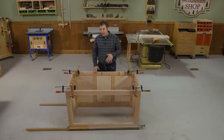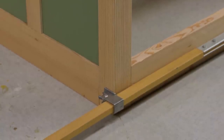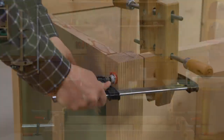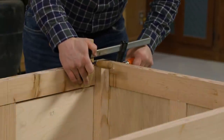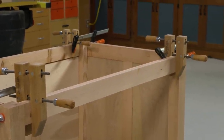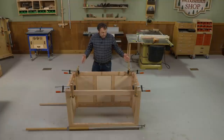I have two clamps that give me the capacity I need to take care of the lower portion of the assembly — they're aluminum bar clamps with a shop-made wood extension, which we covered in a tip on our YouTube channel. Up at the top I'm out of long clamps, so what I did is attach a wood hand-screw clamp to one of the rails, then use a shorter F-clamp to go from the hand screw to the leg and pull those joints tight. At this point you should have everything fitted so it doesn't need a lot of muscle to get tight. Once that's in place, the base just needs to set up and dry for a few hours. And that takes care of the base.